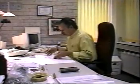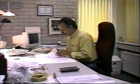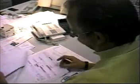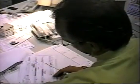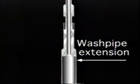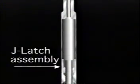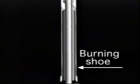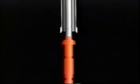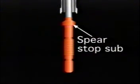If sealed bore extensions are located below the packer without a mill-out extension, another type of packer retriever assembly is run for one-trip recovery. It incorporates a top bushing that crosses over from a boot basket to the wash pipe extension, a J-latch assembly with wash pipe connections at the top and bottom, and a burning shoe. Connected to the inside of the J-latch assembly is a mandrel, spear extension, spear stop sub, and spear.